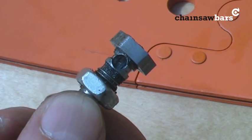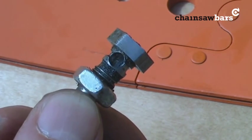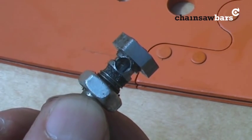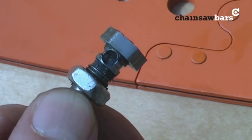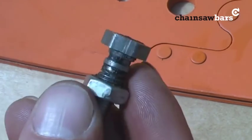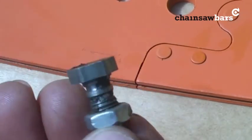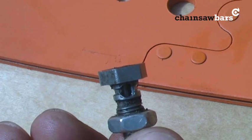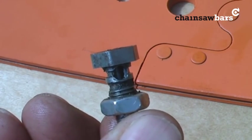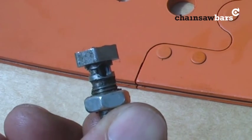A bio chain oil which is quite sticky and gets gunky very quickly. The oiler hole usually is a lot smaller than that, but I've actually drilled mine out and that's easy enough to do. Remember you're only drilling into the channel that is within this bolt — that's hollow there. If you do open out the oiler hole, don't drill all the way through. You wouldn't be hurting anything if you did, but you're only going into the channel there.